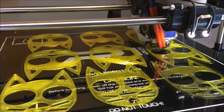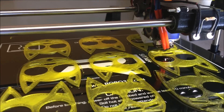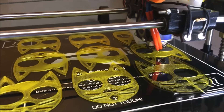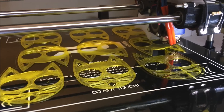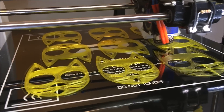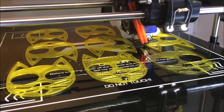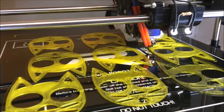Some things to note about PETG: it's a really soft material, a little different than ABS or PLA. It stays relatively hard until it gets to a higher temperature, and then softens quickly — whereas PLA gradually softens as temperature gradually increases. So when you get the temperature wrong or you're just a little bit low, it starts to get goobery. It's not good for every single part. I've made some clips and looms for spark plug wires out of PETG, and within a week they softened up and the spark plug wires just fell right out of it. So I reprinted in ABS.